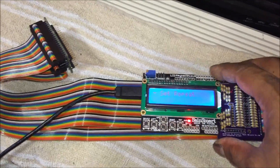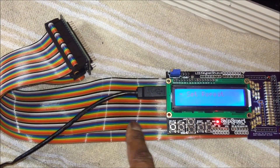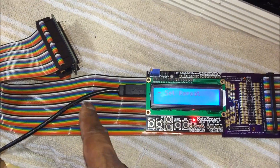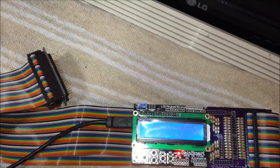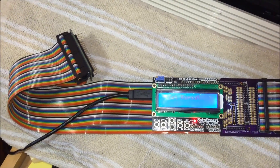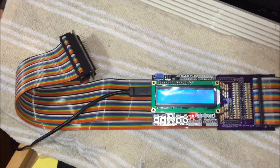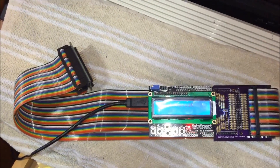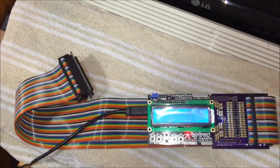One thing to note: Paul Swan used Spectra twin twist flat cable, but I found regular flat cable works just as well with no interference problems. Hopefully we'll use this for any extra testing we need. The goal is to get both Galaxian boards working, and they'll both then be 18-in-1 multi-boarded — we've got the kits for that from Mike Coats, so a quick thanks to Mike as well. Fingers crossed we'll get things working. I hope you guys follow this repair because more videos will be coming. Thanks a lot for watching!